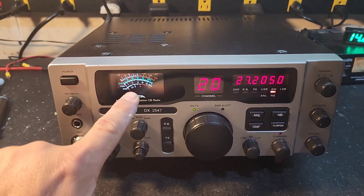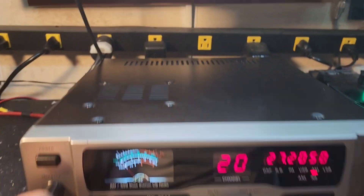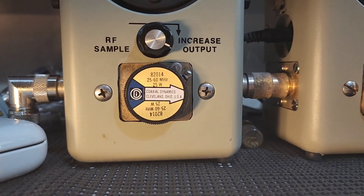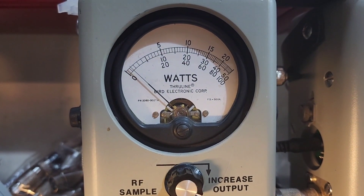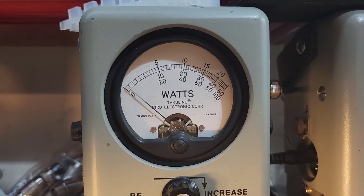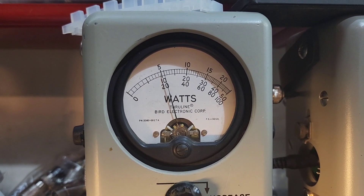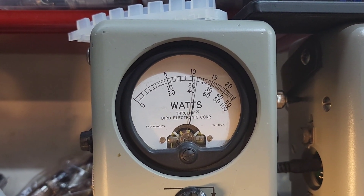You wanted a standard tune alignment and the LED meter light upgrade — we did just that for you. We're going to start with our power all the way down. It's just a single final radio, a 25-watt slug. I set it up where it's down to a half a watt, so if you decide to run an amp you get full adjustability, and five watts all the way up, which is going to give you some clean power.